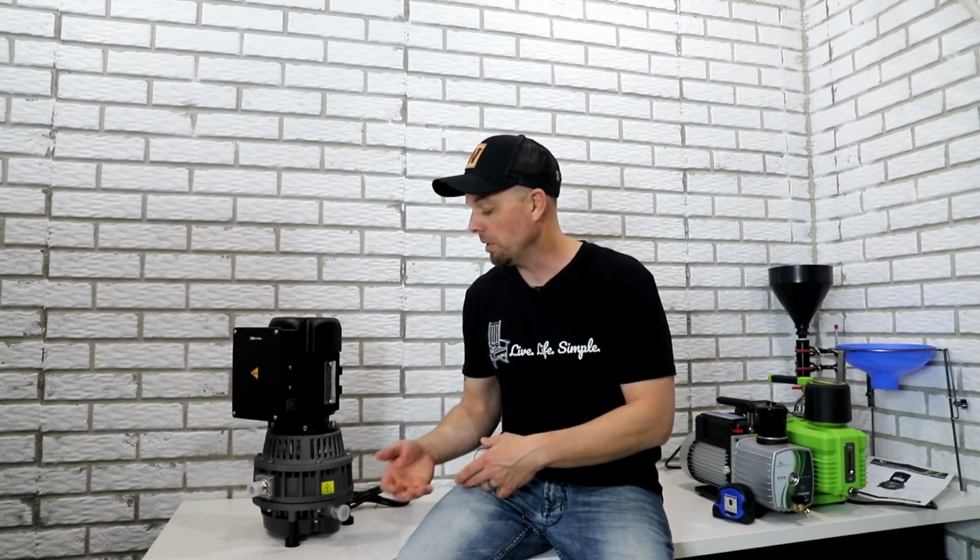On the flip side of that, that could be one of the flaws, because anything that doesn't have lubrication is creating more friction than something that does. So over time, with more friction, you might have more maintenance over the course of years than you would with an oiled pump, because those parts are going to tend to possibly wear out faster.